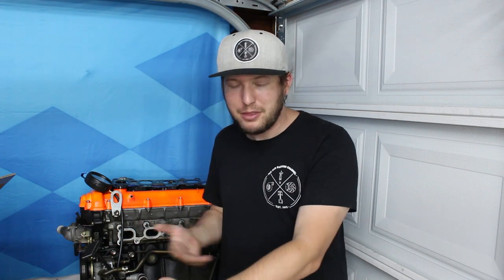If you have the manifold off, it's very easy to tell — just look inside the port and make sure the valves aren't open. You also have to have the spark plugs out, because if a valve is leaking it's got to have air to leak so you can measure what's leaking. Anyways, I hope this video was useful to someone out there. If you guys end up building this tool, throw it up on Instagram and make sure to tag me so I can check it out. I'll see you in the next one. Peace out.